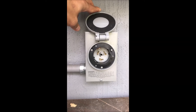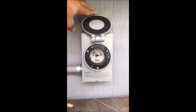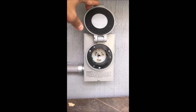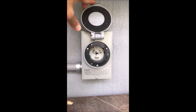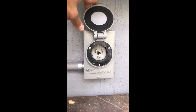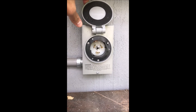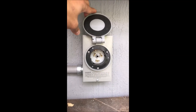I hear a lot of people back-feeding into a stove connection — like for your range in your kitchen — or back-feeding through the dryer. That's a no-no. When you're back-feeding that way, if the wire falls out, those are male connections on there and they're live. So if they fall out, anybody walking by that trips over it, doesn't realize it's live, and touches it — they're going to get electrocuted.